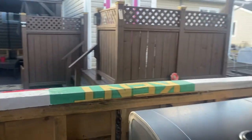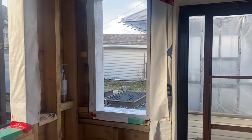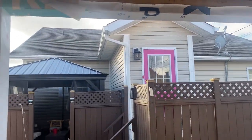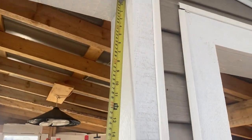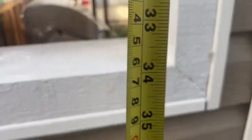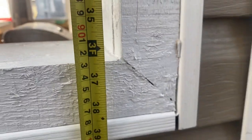That's my goal today — to put the plexiglass in that little opening, in this very large opening here, and over on this side. I think it's going to stop a lot of the wind and most certainly any rain and snow from beating into this outdoor kitchen over the winter months. I'm going to take my measurements here now. I've got my tape put up in the corner and I'm going to measure. It is exactly three feet and about three-eighths of an inch. Always do two measurements — my father always told me, measure twice, cut once.